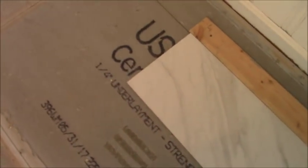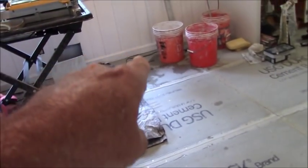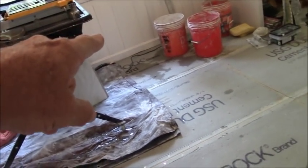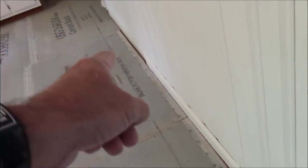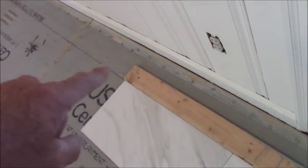On this floor, it's an older house and none of the walls are straight. I wanted to start at one wall, but when I measured for the door jamb the measurement was off — I ended up with a skinnier area on one side and a larger area on the other, which won't work. So I had to go from the other wall, doing a measurement across about an eight-foot span that was true — resulting in about an 11-inch cut instead of a 12-inch cut. Now I have a ledger board resting against that wall, and the pencil line is true all the way down. The size from the wall to the line is about the same the whole way, with only a very slight discrepancy at the end.